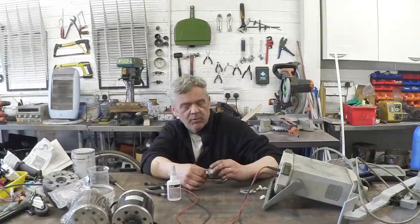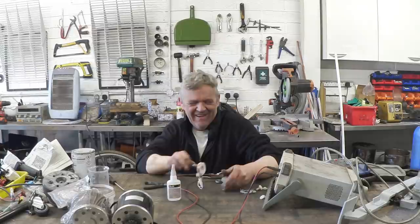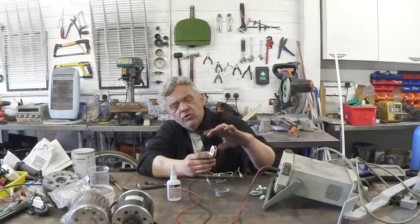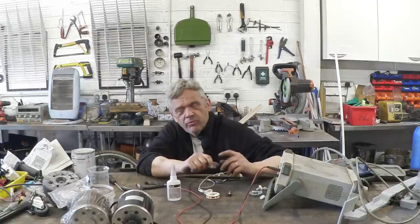Now that's really curious — we did this in video 1030. When we pass a current down here, it's a coil of wire and it creates a north face and a south face. It's an alternating current so the north face and south face swap over. We have the north and south on the edge of the coil, which is what you'd expect. What these bits of bent metal do is direct the flux path.